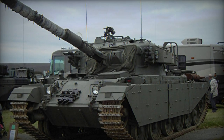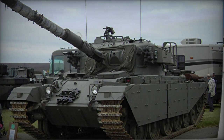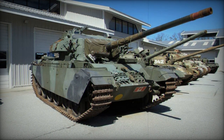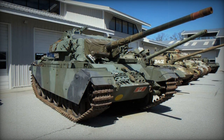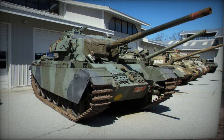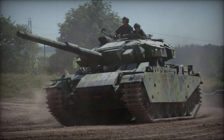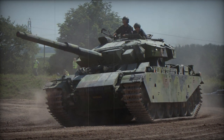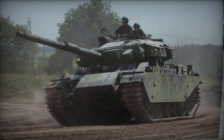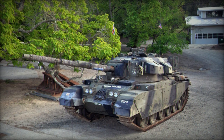The tank turret is fitted with an 83.8mm, 20-pounder, rifled cannon with a muzzle velocity of armor-piercing projectile of 1,020 meters per second and subcaliber projectile of 1,325 meters per second. A 7.92mm machine gun is paired with the gun. The tank gun was designed without a muzzle brake. The tank is not fitted with an anti-aircraft machine gun.